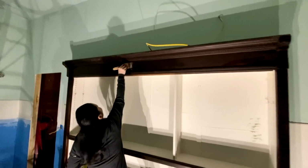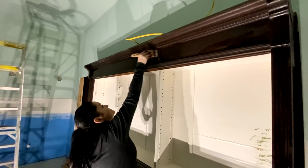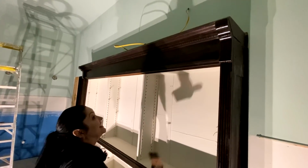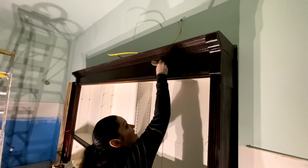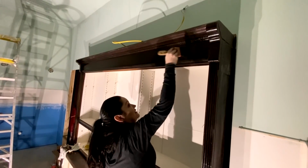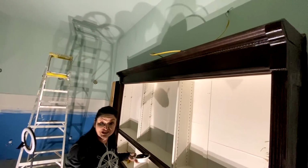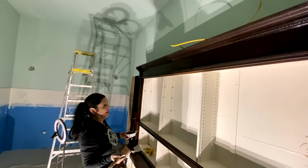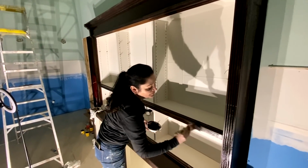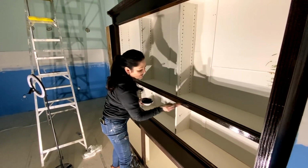All right, Laine, what is special about what you're putting on now? I have hopefully made my own shellac. So I've taken my gel stains. And a lot of dead bug carcasses. There are actually no dead bug carcasses in this. No bugs were harmed in the making of this shellac. This is a modern shellac. Oh, okay. I'm sorry. Go ahead and tell us what you put in it. So this is gel stain mixed with denatured alcohol, which is letting me, as I'm working it up and down, reliquify the old shellac and work it back into the stain. So it looks like it's working beautifully, kind of an experiment, but it appears to be doing the job. Check back tomorrow to see if we have a nasty, goofy mess. We won't. It's going to be good. Okay, good. I'm excited.